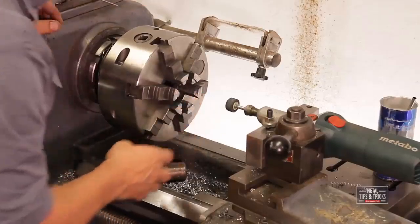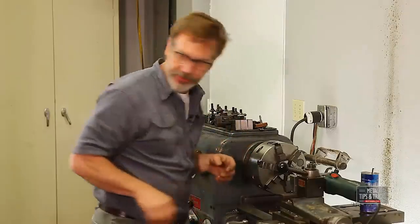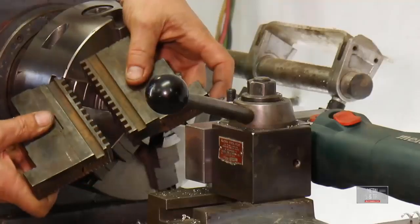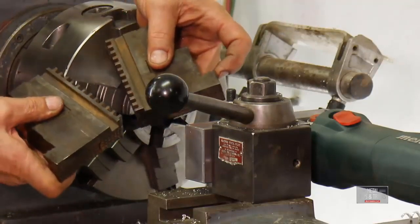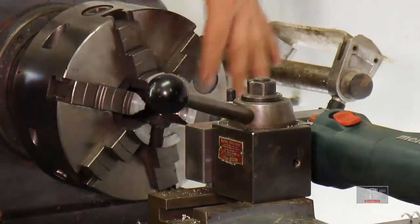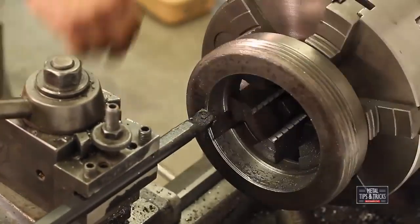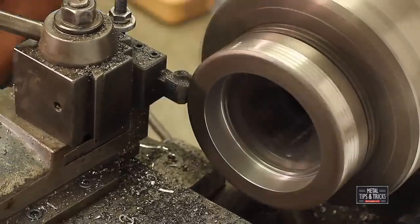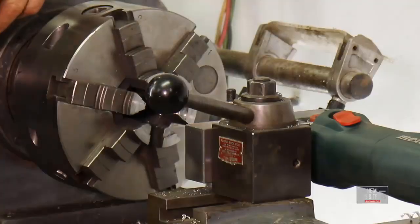Now we're going to talk about doing the outside grind. Since we've got this all set up, for the outside grind we have to look at the jaws again. When we put pressure on these jaws they kink out, but now we're going to put pressure on the outside so they're actually going to kink in. We developed a ring to get that grip; now we're going to do a ring on the opposite side and grind these outside surfaces, then find a larger ring and do those surfaces.